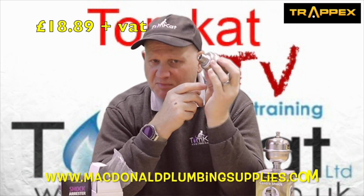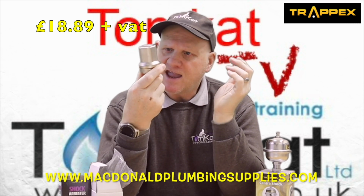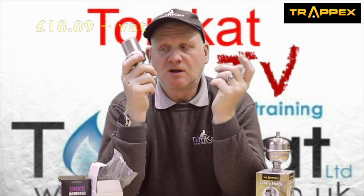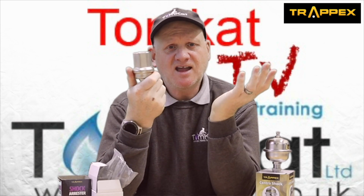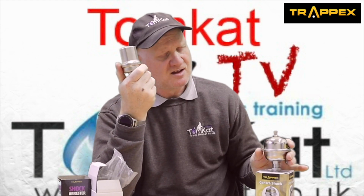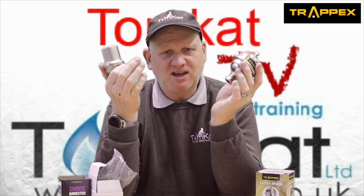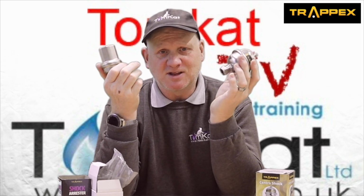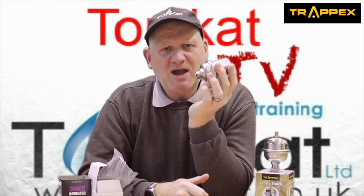And again, you can buy these at McDonald's Plumbing Supplies for £18.89. So that is the mechanical shock arrestor. It's maintenance free. This one will require maintenance every year. It'll need checking, it'll need topping up, because they all need doing that. But this one, you put it on and you forget about it.